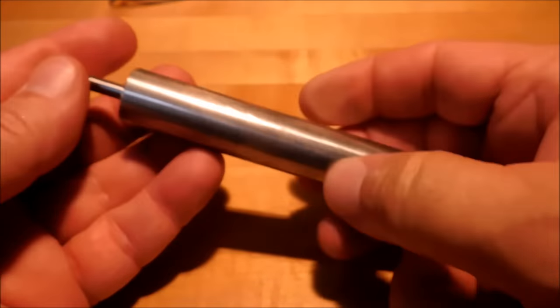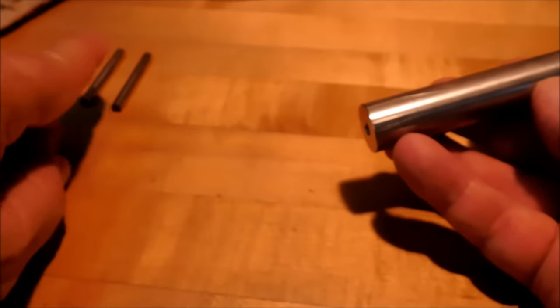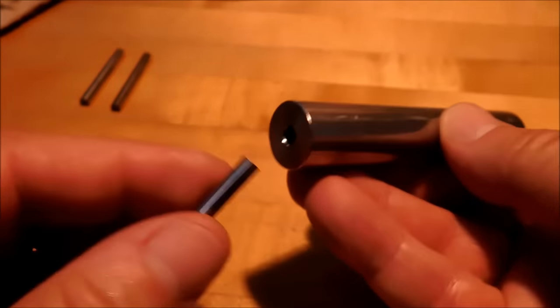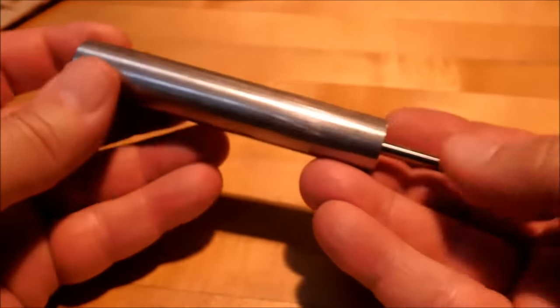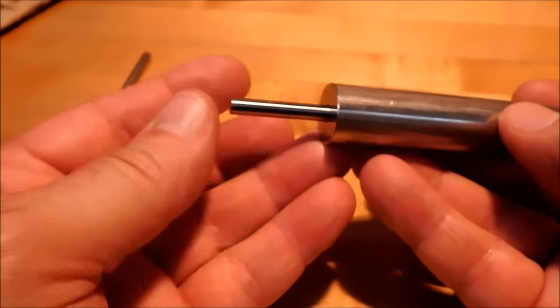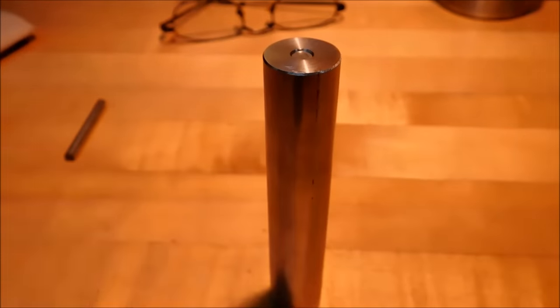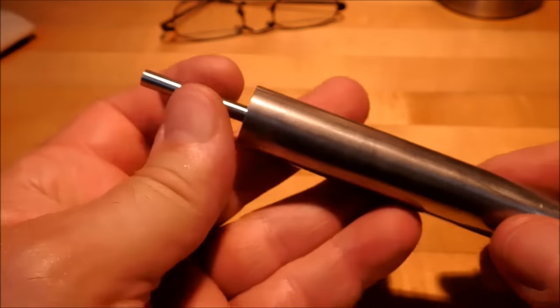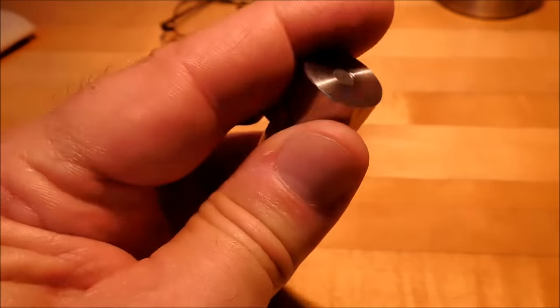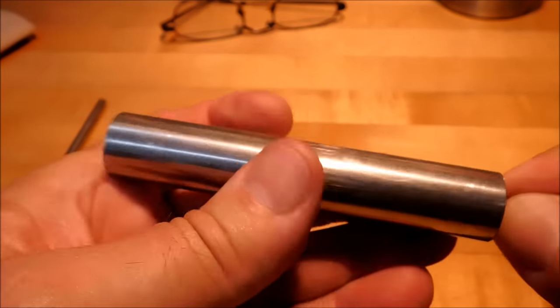199 diameter pin. Yep. All day long. Well within spec. .200, .201, .202. .200. Yep. .200 it is. .201. Now this one should go. I love it. Let's give it a little help. I'd say I'm putting maybe 2 pounds of pressure on that .201. I'm not pushing it very hard, but I am feeling the center.